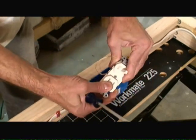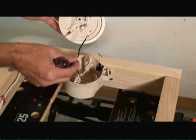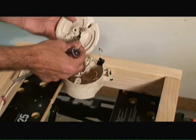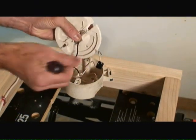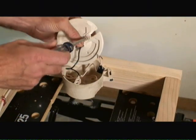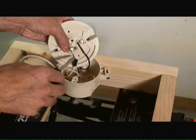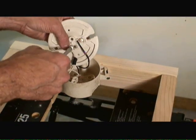So that's it for wiring the switch outlet. We now go up to the light. At the light fixture itself, we're going to take the black wire — the hot wire — that's feeding electricity to one side of the light fixture, wrap it around the brass screw and tighten it up. Then I attach the white wire to the silver screw.